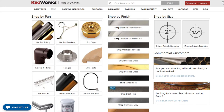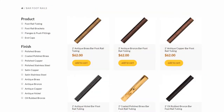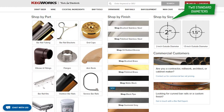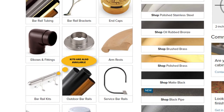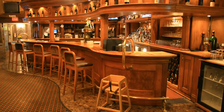Many are familiar with the brass footrest typified by ornamental rail brackets, elbows, and end caps as shown here. With the rise in do-it-yourself bar construction projects, many websites such as Kegworks and ESP Metal Products have expanded offerings which include many architectural finishes. This type of footrail is normally offered in one and a half inch and two inch outside diameter tubing and often sold as kits. This category of tubing is what's referred to as lightweight or thin wall tubing, which is why it can also be formed or rolled in circular shapes.